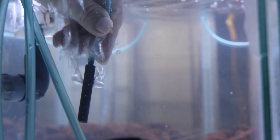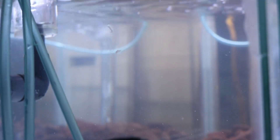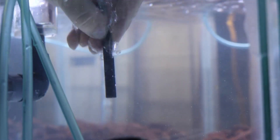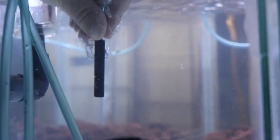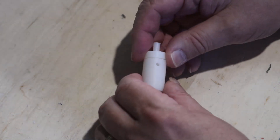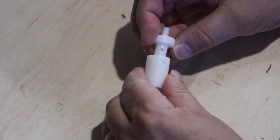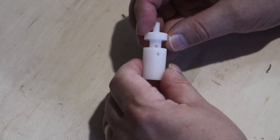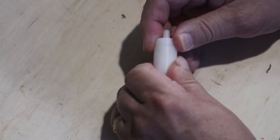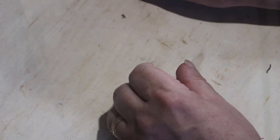So I thought maybe what we could do instead is go to a larger diameter and then machine that so there's a much bigger hole, and then have a bit of adjustability. I didn't want to go too large in diameter because as soon as you get too big a piece of pipe or delrin you're going to end up restricting the flow. I really like this size, but just to test it out I'm going to go up to I think three-quarter inch and machine that. Obviously I can machine this down further, but the whole point is to find something simple and easy to put together that I could run off half a dozen whenever I want — once you have the lathe set up, it's easy to knock off more of them.